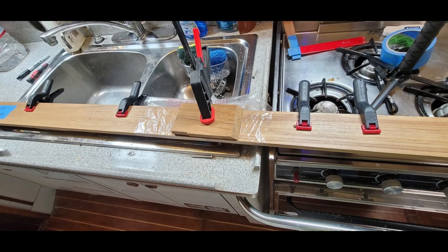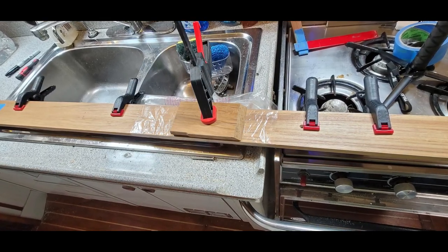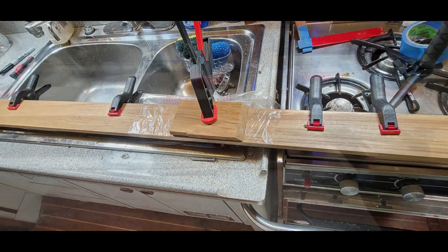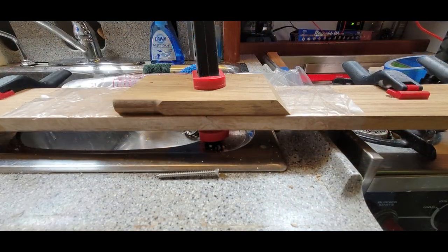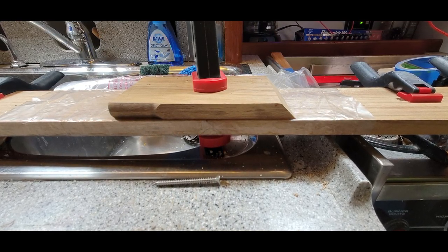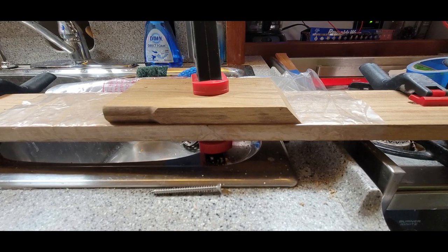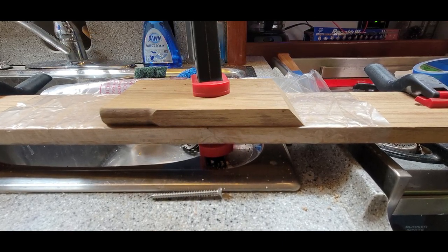Mixing a little bit of plywood sawdust in with the teak sawdust keeps it from getting too dark, and I think we color matched it real well. So we're happy with how it's turned out, and the result is fabulous as far as we're concerned, and this is going to work for the job we're using it for. If you've got any questions, or any ideas on how to do that, or if this is an idea you've used before in the past, let us know.